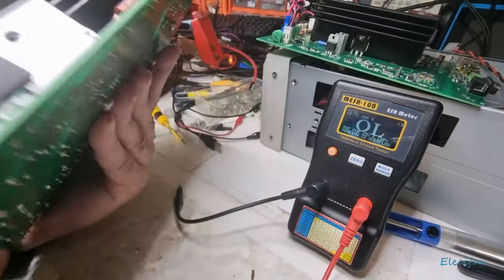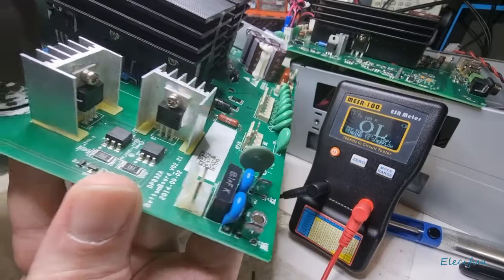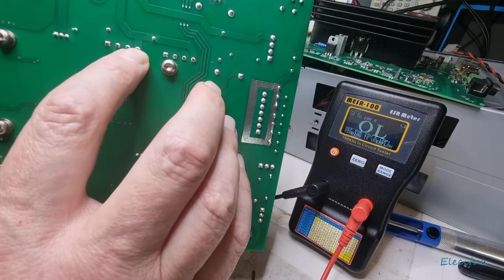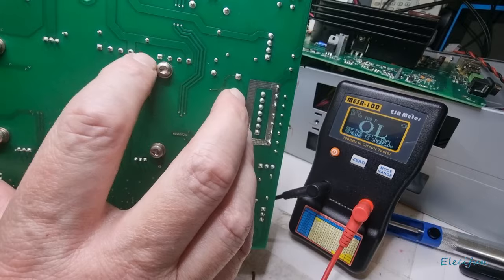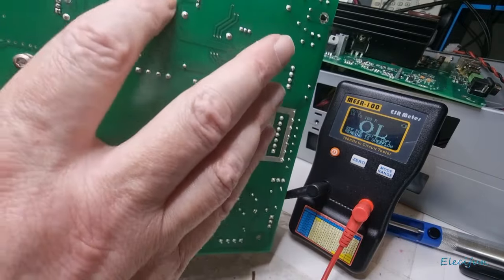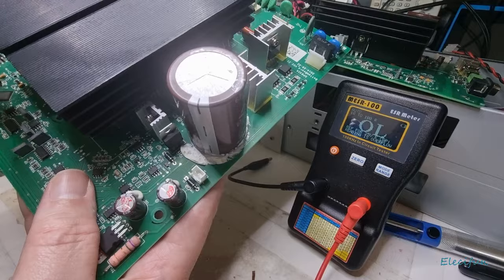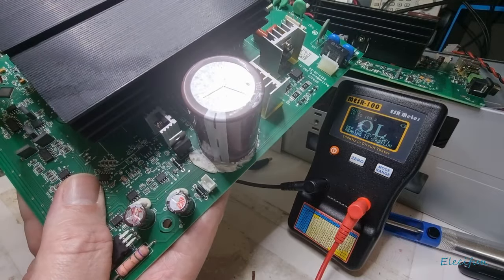I'm not sure which one is which. This one here, even though it looks like it's got a couple of bigger transistors, they're not. So that's going to be the ground, that's going to be positive, and those are the AC connectors — positive, ground, and AC connectors. You can tell the ground from the big trace that comes through the ground here. I've already taken this out just to check what the actual microfarad reading is on there.